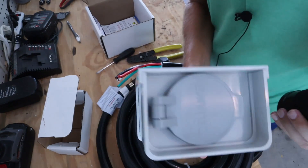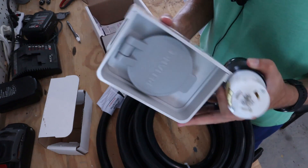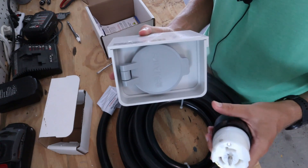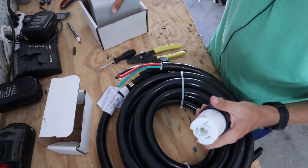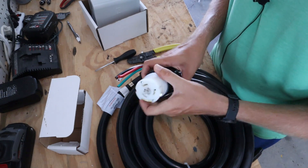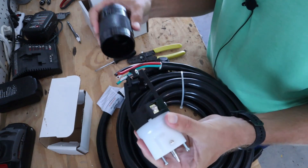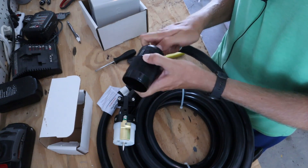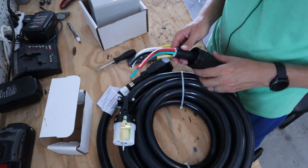This female plug goes into this Reliance inlet box, which I haven't installed yet — this is going to go on the outside of my house, and then we'll run cables from it to my main panel at the meter. The plug goes in here and twists and locks in. I'll make a video on that and link it in the description or in the top right of this video. First, we take the female twist lock plug and the sleeve just pulls right off. We run all our wires through it and slide it down out of the way.